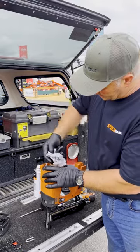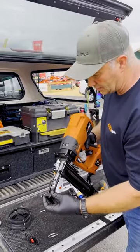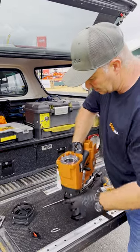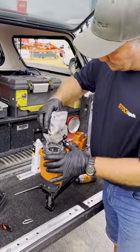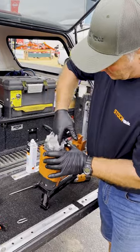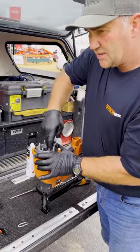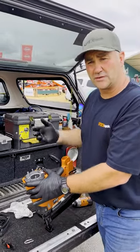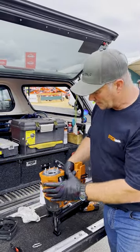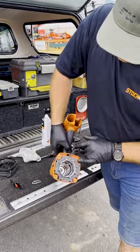Clean in and around the nose of the tool and the head of the tool. Put the nose on and depress down to clean inside the combustion chamber at the top. This tool is not super dirty, but this process wants to be done every 8 to 10 boxes of staples — so every 10,000 staples. We've now got a nice clean bore and clean piston chamber.